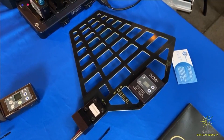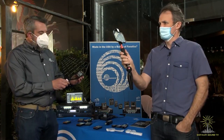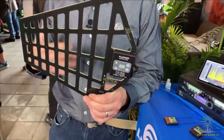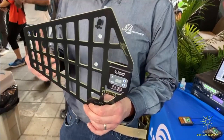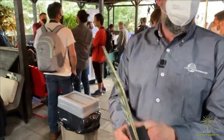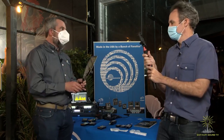This is the ALP 690 — it's reasonably new. It is an active antenna with gain; you can go negative 6 to plus 12. The thing about active antennas and gain structures is it's not about boosting your signal, but really about cable run and RF overload. If you're running 100 feet of cable, you'll want to find out how much RF you're losing and boost the gain accordingly. If you're sending too much RF, you can go negative with the active antenna. It's a powerhouse directional antenna, and it does have filters — filtering 470 to 608 or 470 to 700, depending on what you're using.